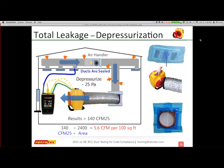That's actually the difference. It wasn't that long ago that 6% was a great target number to reach. That was actually Energy Star. That was a heck of an achievement, to have gotten your ducts below 6% or 6 CFM per 100 square feet. Those days are gone. The real purpose behind much of the code that we talk about was to convince builders or HVAC installers to put your duct systems in the building envelope, into the thermal barrier, so that you don't have to test, and everybody wins with a much better option. I disagree with the fact that you don't have to test. I still think you should test, and all the air should go where it belongs.